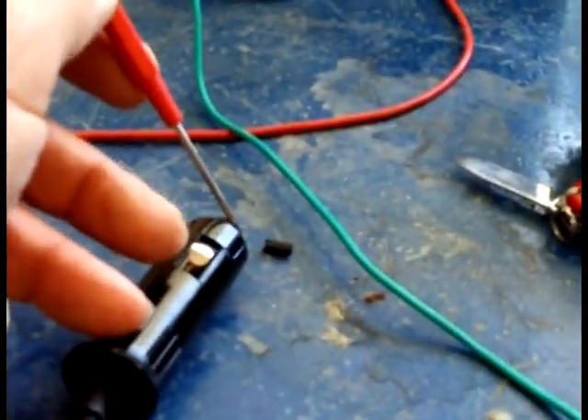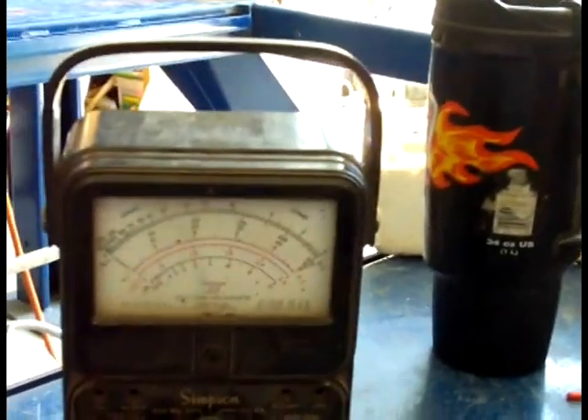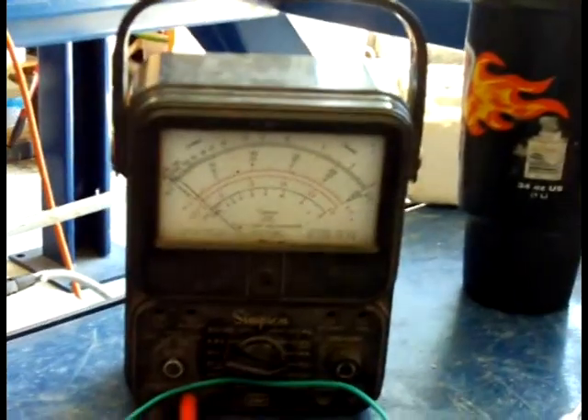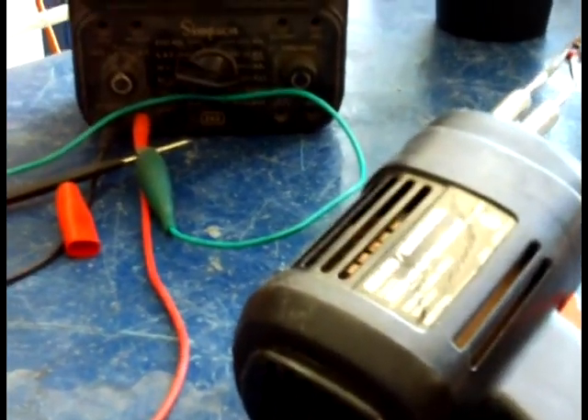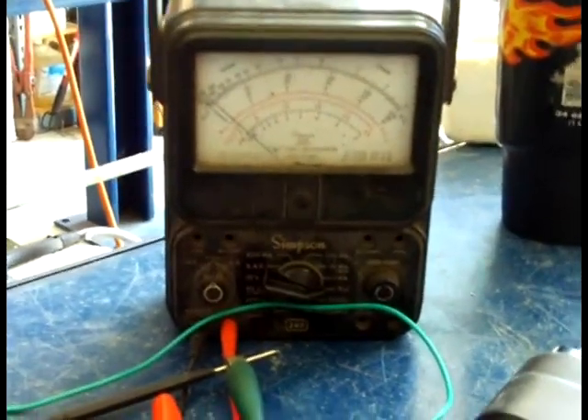We've got that securely soldered, and I do recommend soldering for these — not the little clips, snaps, and twist ties. They just always fail. We've got the other one cut and stripped, hooked up to one side. We go back and test the center probe and see that is indeed the hot side. Just to be sure, we go back — nothing there — just like it's supposed to. Everything's good to go. We've got both sides isolated. I'll solder that and be right back.